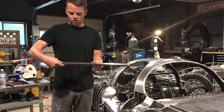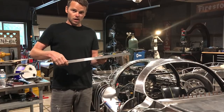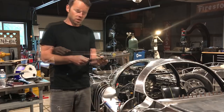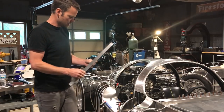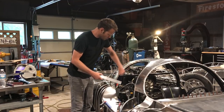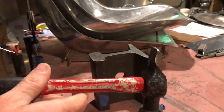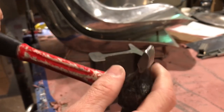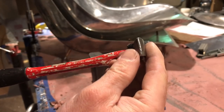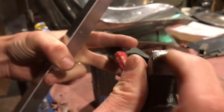We need to take this piece of aluminum and implement a stretch along this surface. The way we're going to do that is with a linear stretching die — we want to create a radius in this piece so that it will match the radius of this door arch right here, the B pillar area of the car. Now the linear stretch I was speaking about can be done with a simple body hammer like this — you use the flat wedged end of it.